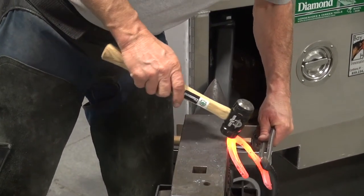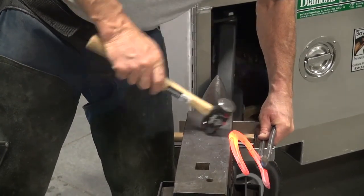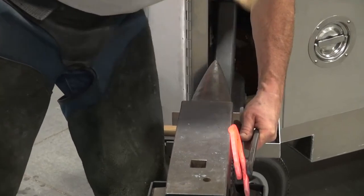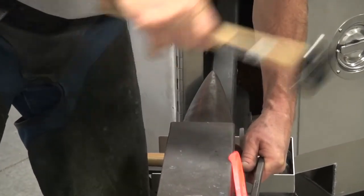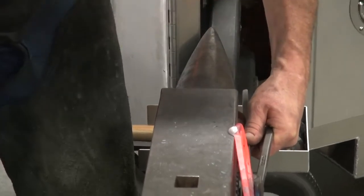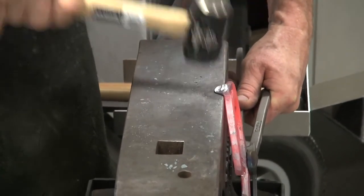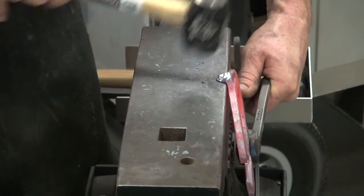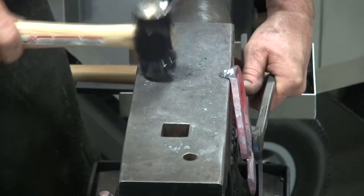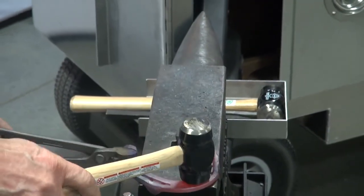Using the round side of the hammer, I'll set the shoe at an angle, put a dent in the back side, and drop the tongs. Draw that material out of the shoe and onto the anvil with small, repetitive blows. Flatten it out — flatten the shoe out.